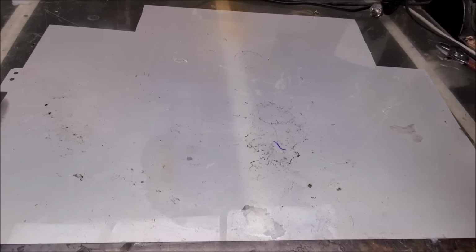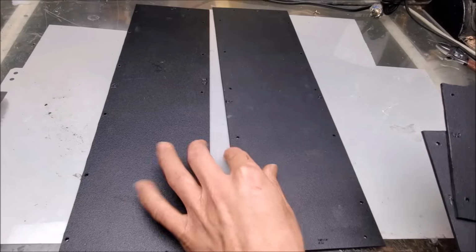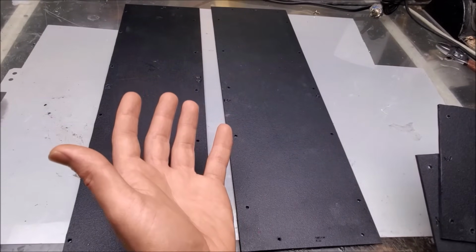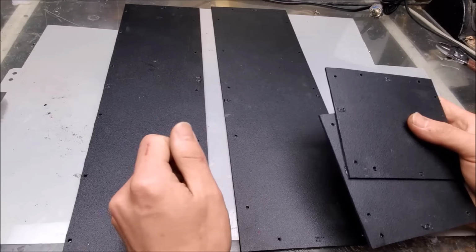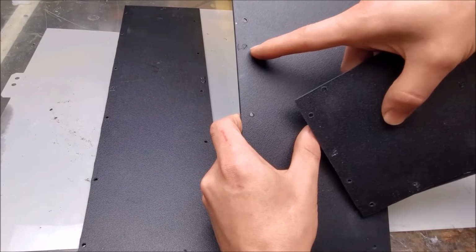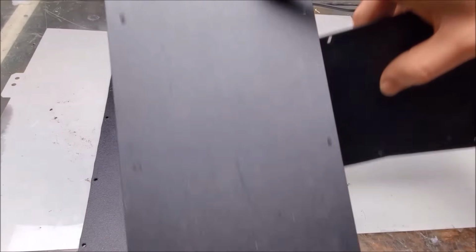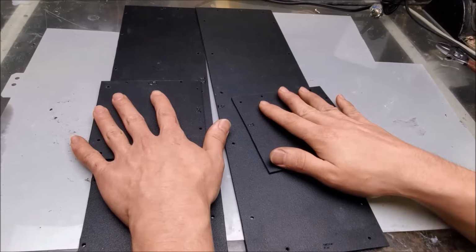So, to start off with, I have these 4 pieces that I cut out of plastic. Now, it's really easy to cut this kind of plastic. What I do is I make my measurements, I get a straight edge out, and use a box cutter or some other sharp tool to score along the straight edge, and you can snap your pieces out pretty easy. You'll also notice that the holes are drilled, and I have little index marks for what piece goes to what piece. So 4 here, 10 here, 8 and so on, all the pieces. That way I know how it all goes together.